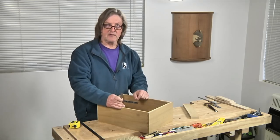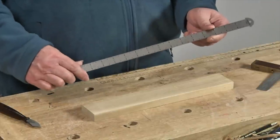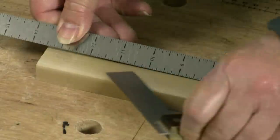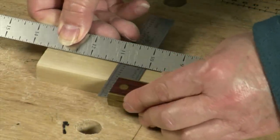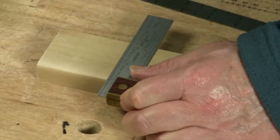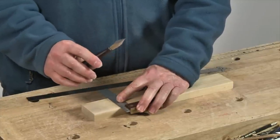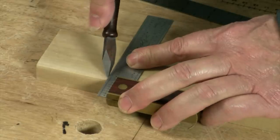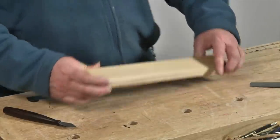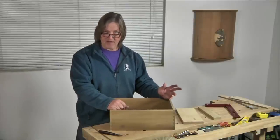I can move these rules up or down to make sure the inside surfaces of this box are perfectly parallel to one another. A hook rule is also a great tool for transferring measured dimensions to parts you want to cut. I'll use this rule to position a tri square at just about eleven and a sixteenth and a skosh from the end, then use a sharp marking knife to put a single super-thin line precisely at that dimension. Now the part is ready to cut.